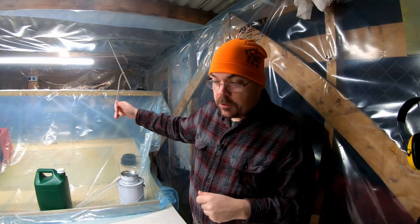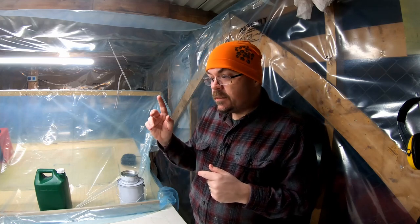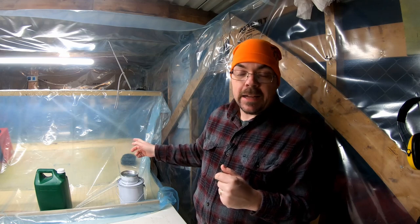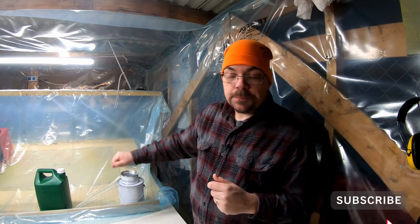The heating tent is up, as you can see. The fans are going and the polyester is starting to get cured. I had a little bit of problem. I don't know why. Maybe it's the temperatures and humidity going up and down a little bit here in Sweden right now. What I'm actually thinking, I read something about that the brand of polyester that I use might vary in quality. The fairing I did on the big surface around the middle part actually didn't cure in 48 hours. They usually cure way faster. I haven't had any problems earlier.